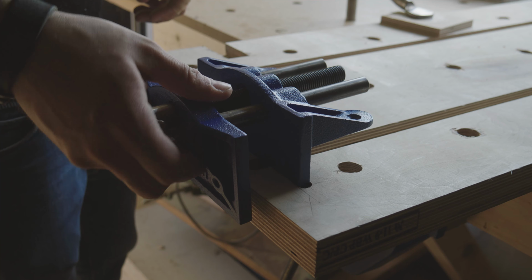So again the outlines are marked and then sawed as far as possible with a Dozuki Japanese saw. The last saw strokes are finished with a Ryoba because you can cut deeper with it. The cut is a bit off course in some areas, so I chisel out the last few millimeters until all 4 cutouts are exactly the same.